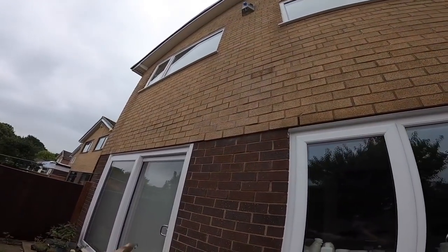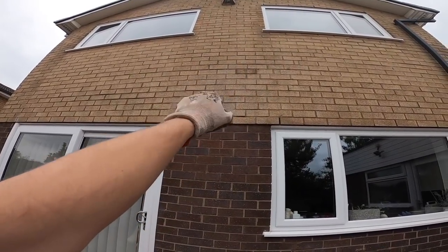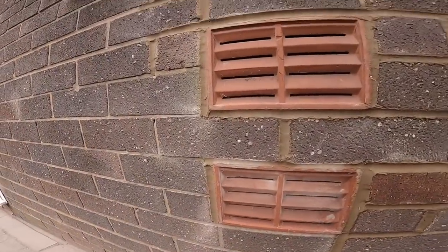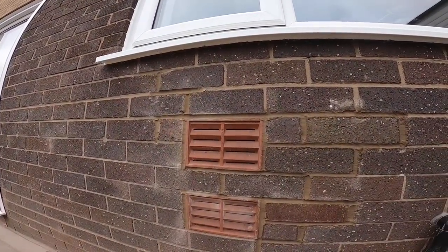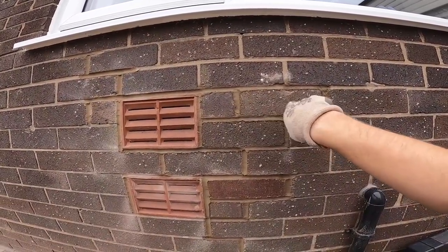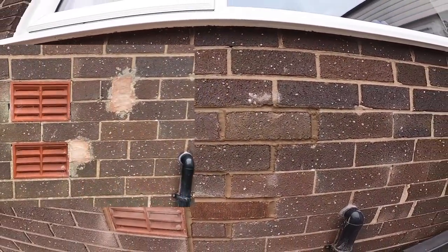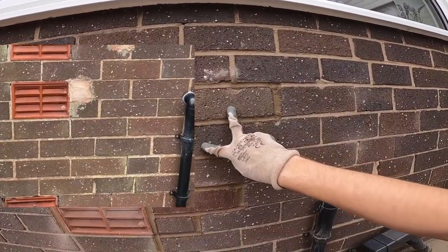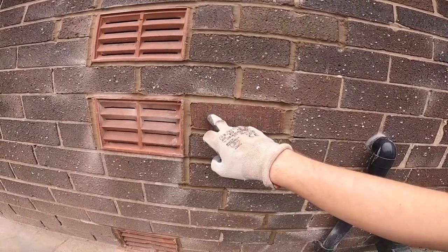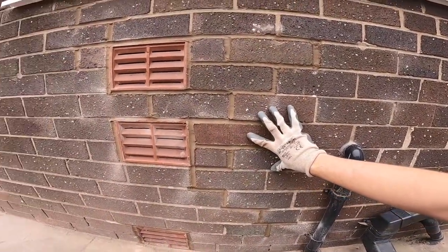My dad did the buff brick for me. He went up there and did that while I was doing that, so he got that in. Perfect colour match, but again, discontinued brick. Very hard to find. And here, my dad raked out the cracks in the joints, so I repointed them, and me and him took out these bricks. These ones had a drill hole in them, so it was all just full of mortar and expanding foam. So I've patched it up with two existing bricks, so they're a perfect match. And this one, again, there was a drill hole, so I've replaced it with one of our bricks that we used over there. So it blends in a bit better with the rest of it, I feel.